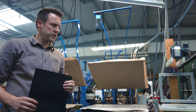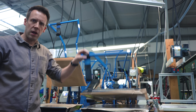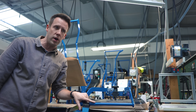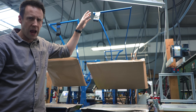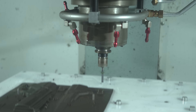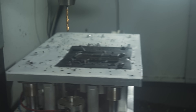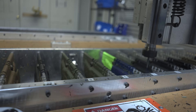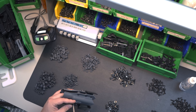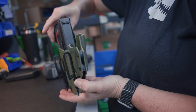The first thing that we're going to do is remove as much variation as possible from our heating setup. These are the presses that we use to heat Kydex and they're a vast improvement over the previous system, which was toaster ovens - really, really hard to get accurate consistent temperatures in those. These are better, but there's still a lot of variation. We've done a huge amount of work removing variation from other steps on our production line. We've got tolerances tightened up on the CNC machines, in the bending and the notching. Even hardware has specific fit guns and specific tolerances dialed in, but now we're going to try to do this with our heat press.